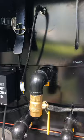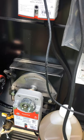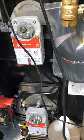We covered the oxygen sensor already. It basically self-adjusts the air-to-fuel ratio. That bottom damper will open and close to make sure it has just the right amount of air for the amount of wood gas being produced.